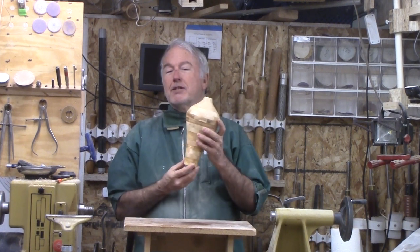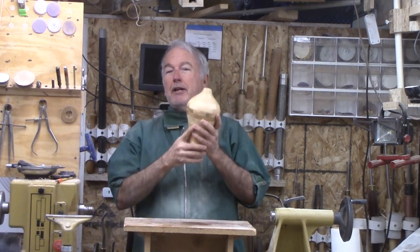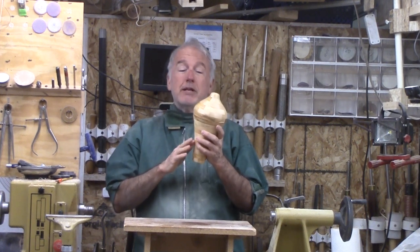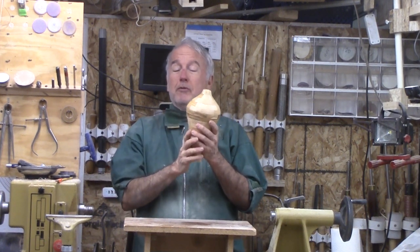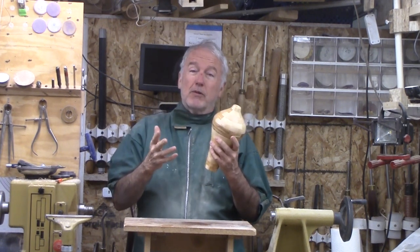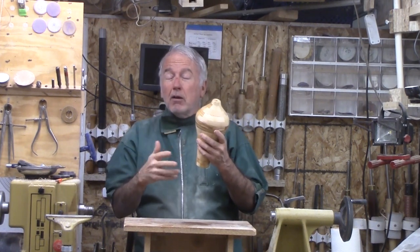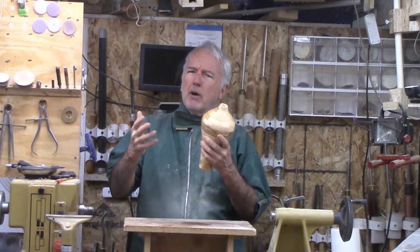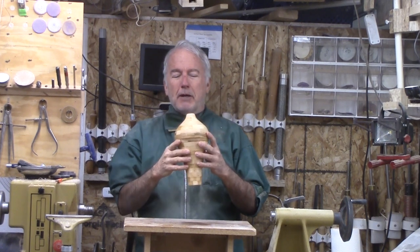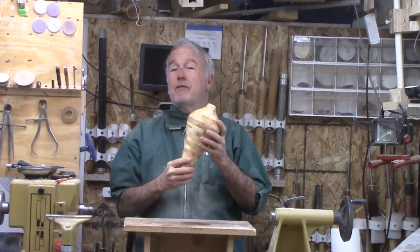For this project, I'm going to make this segmented vase. Very small opening, light hollowed. What is very unique about this one is that I did not do a detailed plan with the exact curve. Instead, I made a bunch of segmented disks, 2 or 3 different sizes, stacked them up, and wondered what kind of form spoke to me. I had to add a couple more rings to make it work, but then went ahead and turned this in a very rapid fashion.